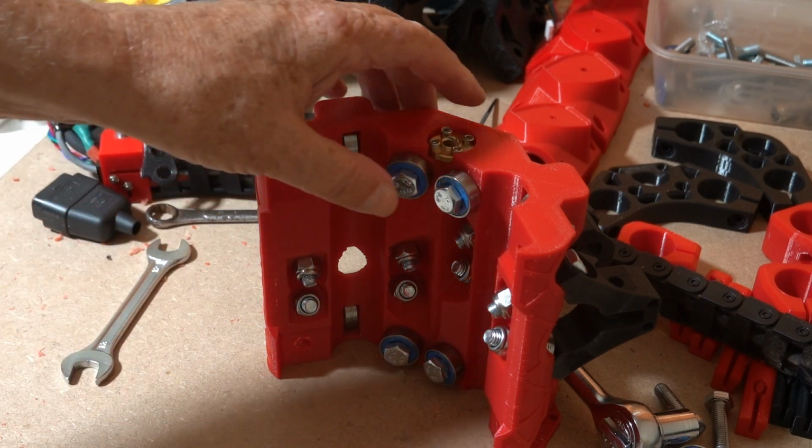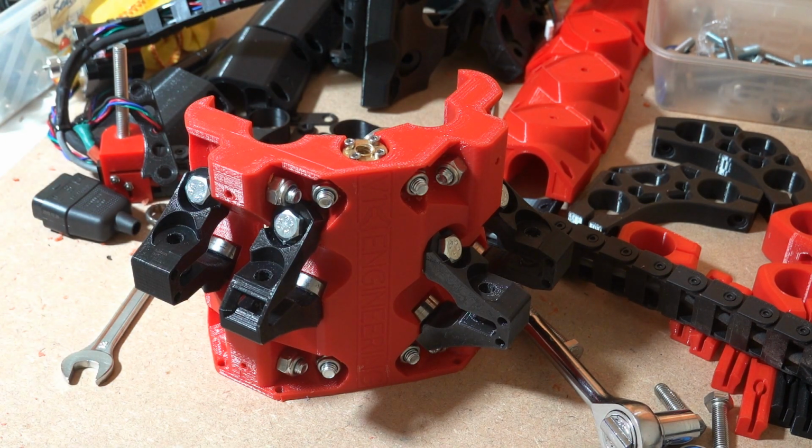Okay, I've more or less finished the core now. I realized I can't carry on because I was going to use the vitamins from the old Burley, and everything's been beefed up on the Primo, so I've had to order some more parts. I went back to the parts list. Seems like all the M4 bolts are now upgraded to M5. Everything's a bit thicker, so the M8s are longer, and so on. I just about got away with doing the core. I need to wait for some more nuts and bolts to come from Amazon before I can continue. So watch this space.